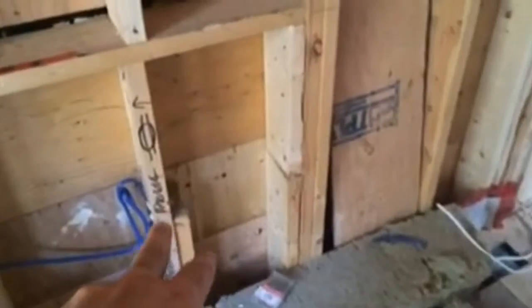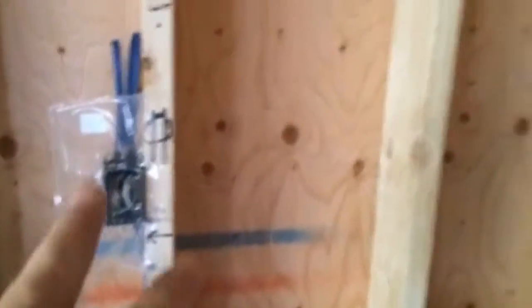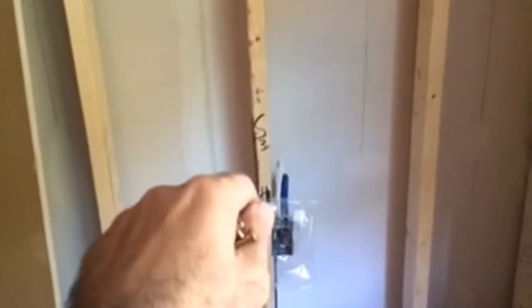Once everything's finalized, the electrician will then come on site and actually mark all these little markings. You'll see circles with two lines — that would be a plug. Anywhere you see S's on the wall, that'll denote where they'll have switches. Here you have an SS which means there are two switches side by side. If you have an S4 or an S3, it means it's a three-way or four-way switch, which means it's a single circuit controlled from a number of different switches. So you could turn the light on from over here and turn it off, but then flick it back over there and it would still control the same circuit.